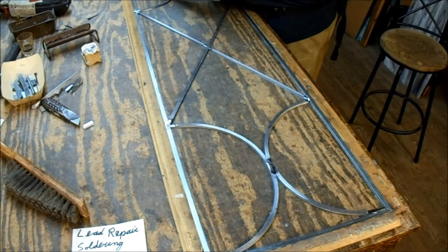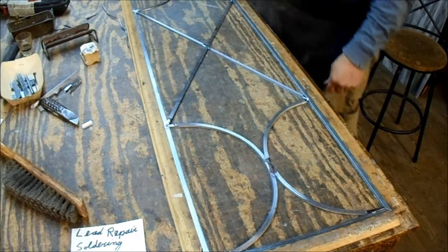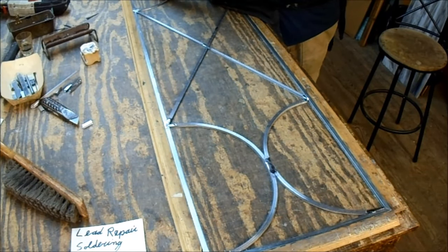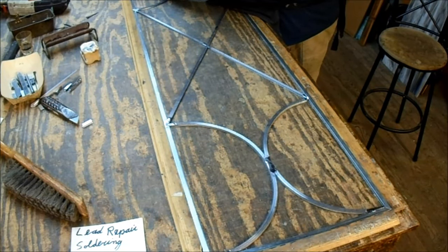The other thing about soldering to zinc is that it takes a lot of heat out of your iron. It's basically a heat sink, as is your solder. Too often we get folks that are soldering there. They don't have it. Turning up the iron is wonderful, but your iron is not a hose. It's not like turning up the water pressure and getting more steam out of it.